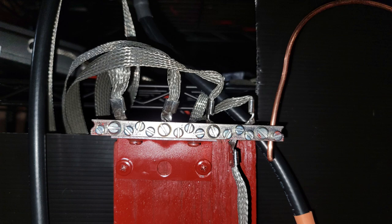You can also see the number 8 copper that routes around and heads out down to the two grounding rods. I'm using two 4-foot bars in the ground. If you can put an 8-foot lightning rod in the ground, that's great. Sometimes your soil conditions may make that difficult or even really impossible, so you can go with two 4-foots or even four 2-foots. You want to get as much metal in the ground as you can.